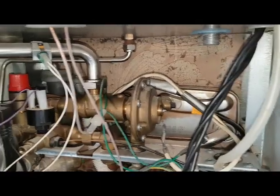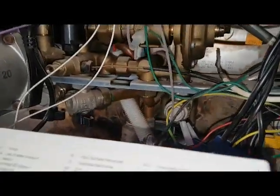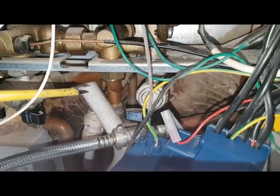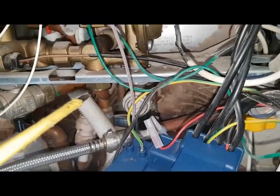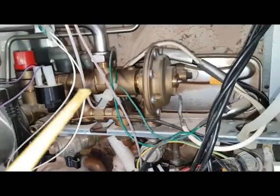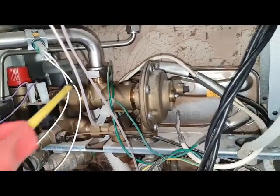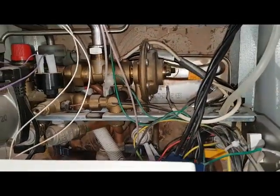So what I'm deciding to do is take the diverter valve out and the plate heat exchanger together. In order to do that, there's a screw on the underside of this section which I've already removed. I'm also going to disconnect this nut — that's the hot outlet and this is the cold inlet. I'll loosen this nut as well as this one here and that one there, and hopefully the whole thing will lift out together.